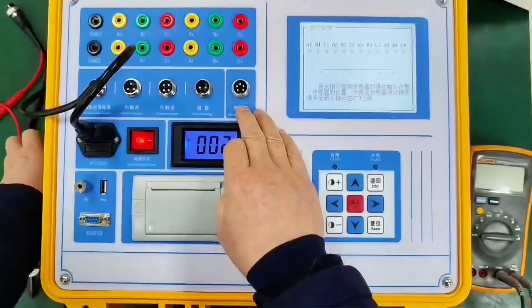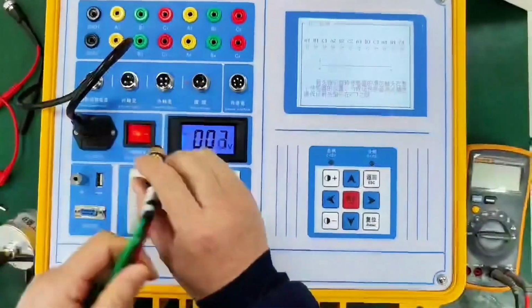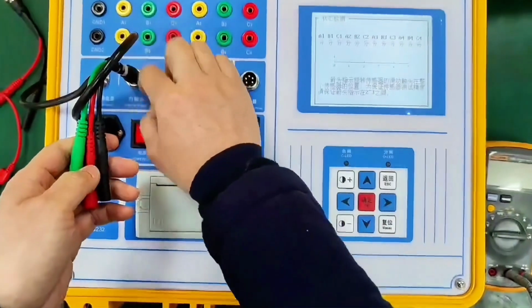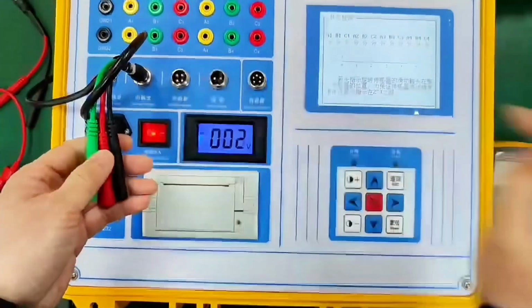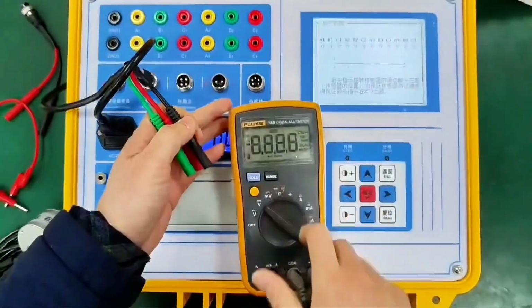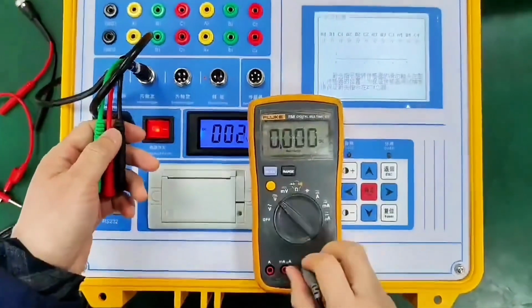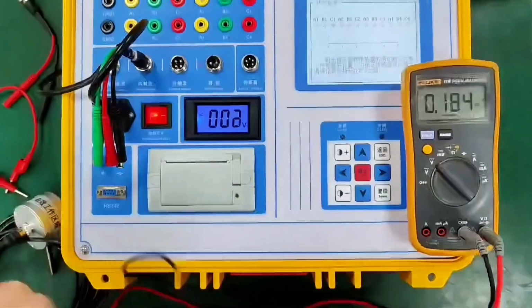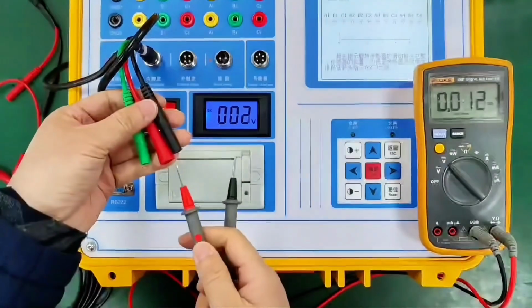And then we make the most important judgment: is there any output voltage? We short the fracture cable. This internally triggered power short cable, we connect, then choose a multimeter. Turn the multimeter to DC gear. Then we put the red and black stylus of the multimeter to connect to this internally triggered red and black short cable. Then we choose to test the manual split below.